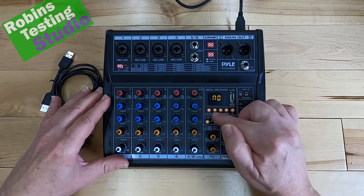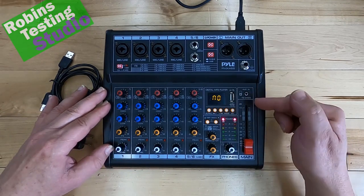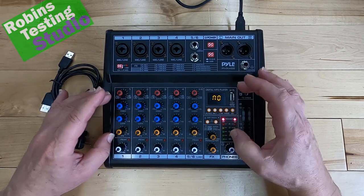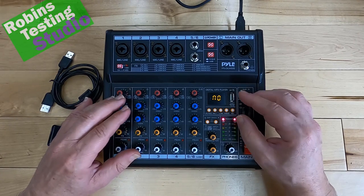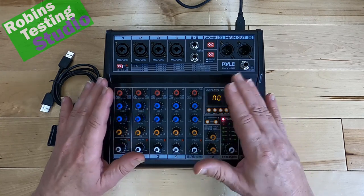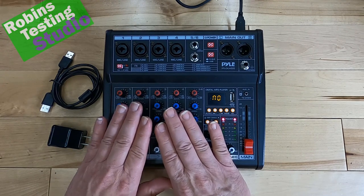USB stick and you can then press the actual record button. Now remember, the recording function doesn't allow you to hear what you're recording immediately. You have to play it back. So when you do use record functions in the actual mixer like this one here, you are going to have to do some sampling with it, find out what levels work best for you, 15-second record, playback, do a couple of adjustments, play back and forth, record. Do that a few times, you'll find out what settings are going to be best for your recording